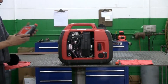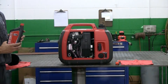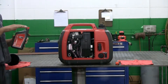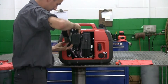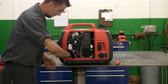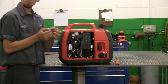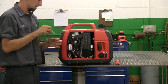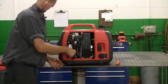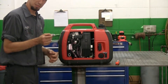When refilling your Honda generator, you want to use Honda 10W-30. They recommend 13.5 ounces to fill the machine, or up to the very top level of the threads. Once you've filled it to the proper level, make sure it's at the very top of the threads inside the hole. This also comes with a dipstick so you can measure — they don't recommend you screw it in. Just push it until it's at the threads and pull it back out. You'll see where the level is on the stick.